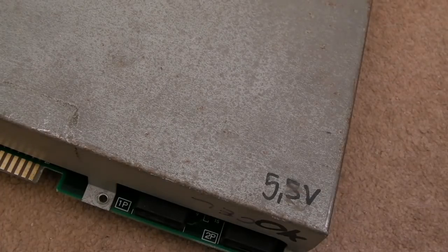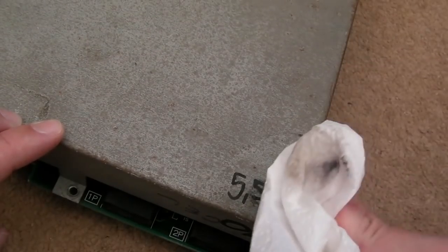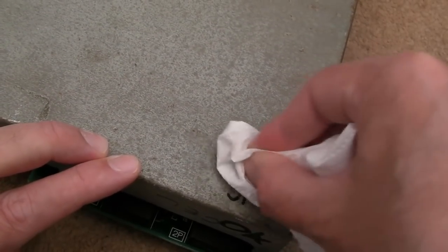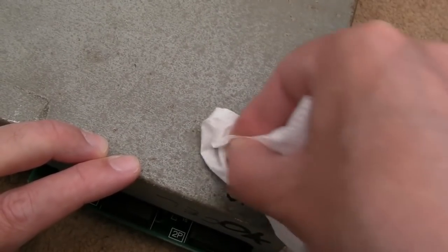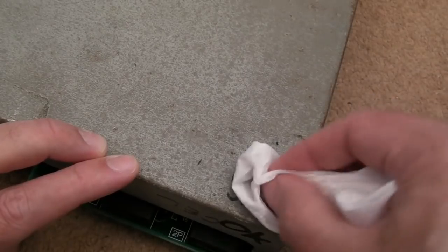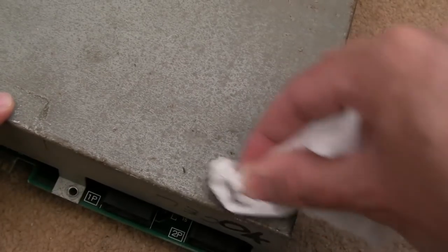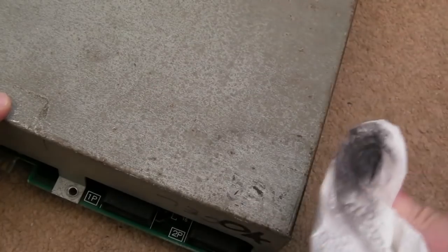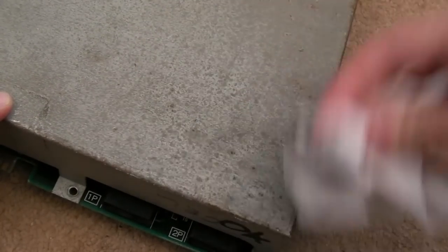So let's clean that off. What I would say is, if your power supply has to be at 5.5 volts, you're getting voltage drop. You know, the power supply might not be providing enough current. Is that coming off? God, that's welded on, if someone's used permanent marker. Oh no, it's coming off. Yeah, so I would guess the power supply used was not providing enough current, or dirty connections, actually. You know, bad cable, not the right gauge, or a bad connection on the jammer. There we go. I think you can say that's gone. And the final thing here, WD-40.